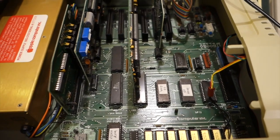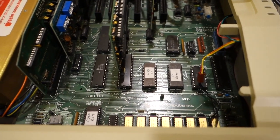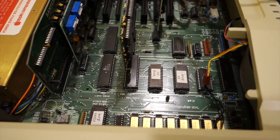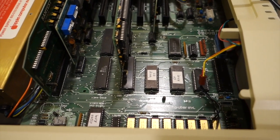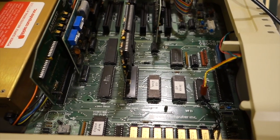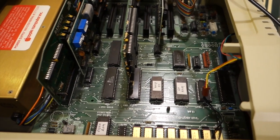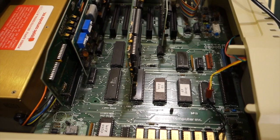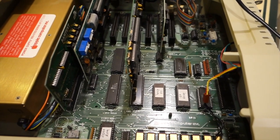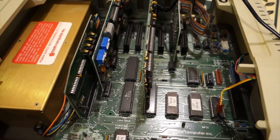The problem is that is just a single channel — it's mono — and on the Mockingboard it was actually trying to just split that between both channels, so it was actually bleeding over all of the sound regardless of whether it was coming from the Apple computer itself or from the Mockingboard. It was bleeding all of the sound into both channels. So the solution is to just cut a trace on the Mockingboard, and I'll show you how to do that right now.